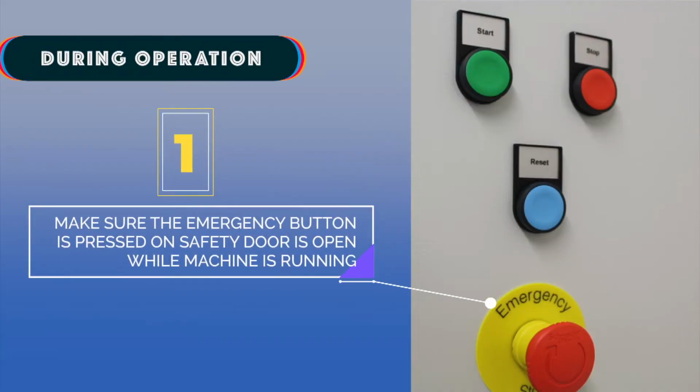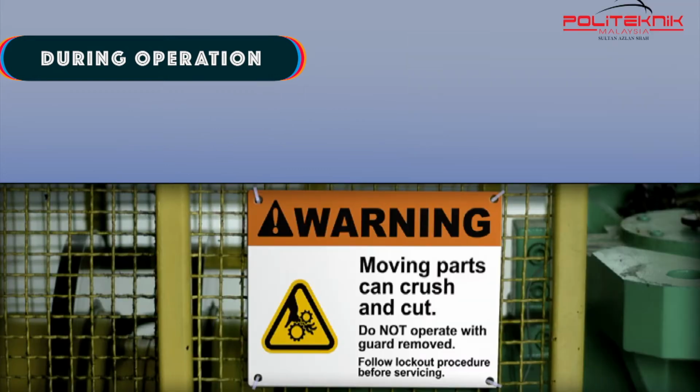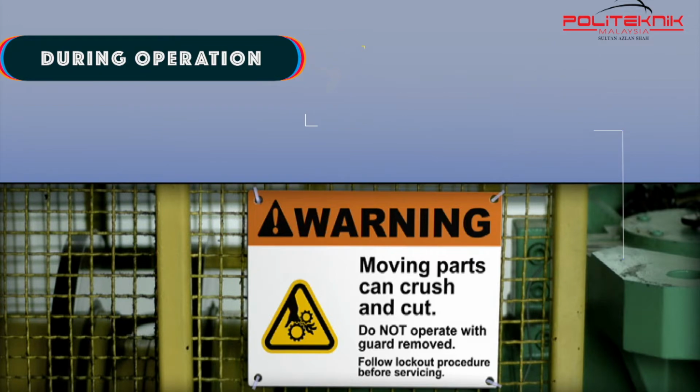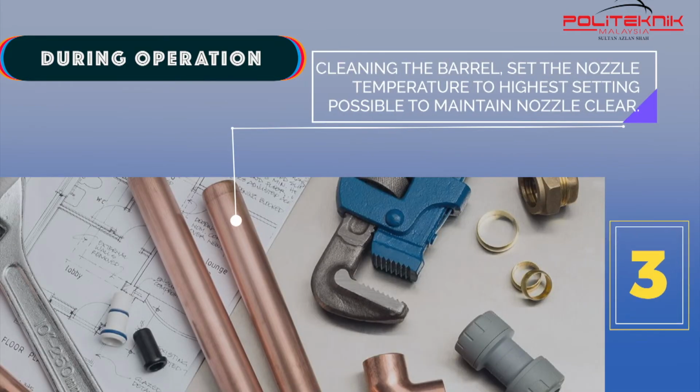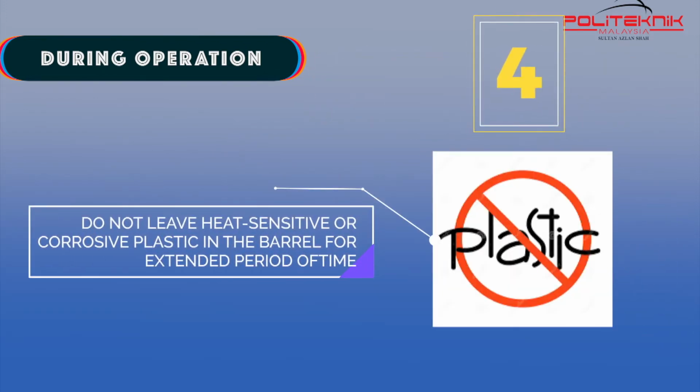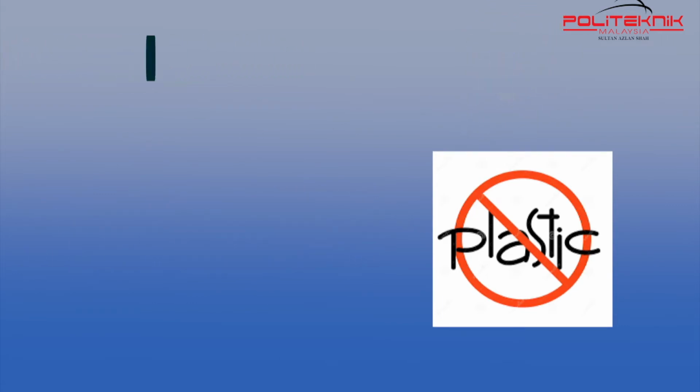During operation, first, make sure the emergency button is pressed if the safety door is open while the machine is running. Second, never remove the leaked molten material by hand when the shooting table is moved forward, to avoid the hand becoming wedged between the shooting table and the mold. Third, to clean the barrel, set the nozzle temperature to the highest setting possible to keep the nozzle clear. And finally, do not leave heat-sensitive or corrosive plastic in the barrel for an extended period of time.